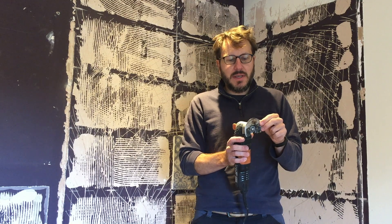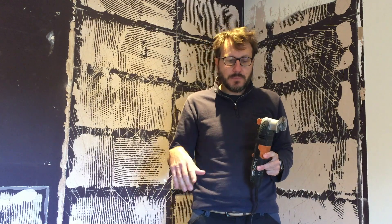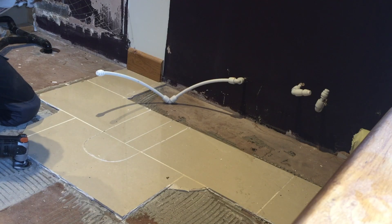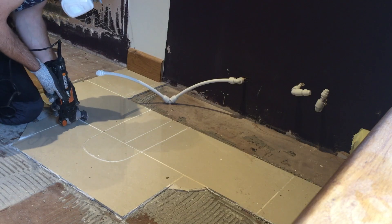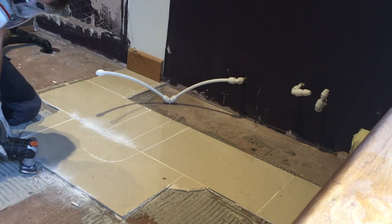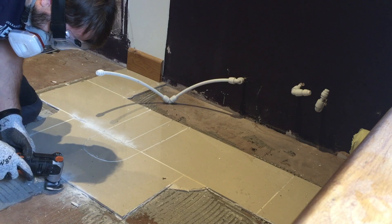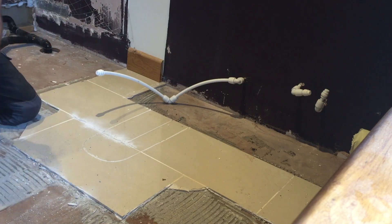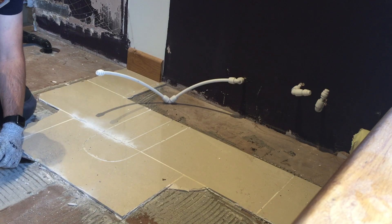What has been super useful is that as part of the master bathroom gutting project we've been doing, we've had to remove a lot of floor tiles. This tool has been incredibly useful because you can cut through the grouting and really stubborn tiles where there's a bit too much cement underneath and it's difficult to chisel or get the crowbar under. You can burrow underneath the tile, cut into the glue itself, and then leverage a chisel into it.